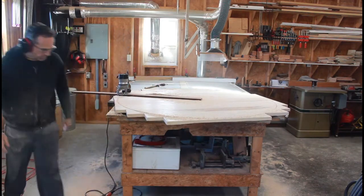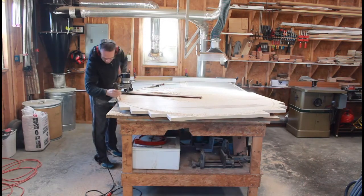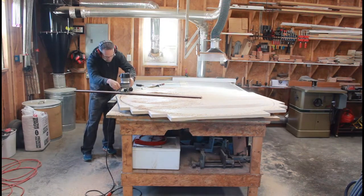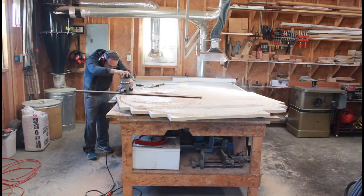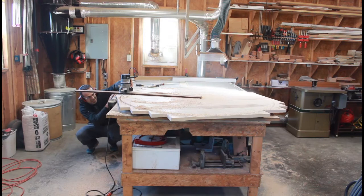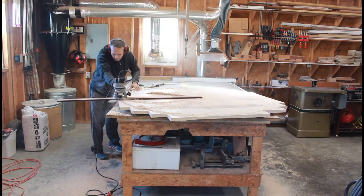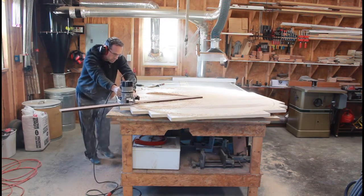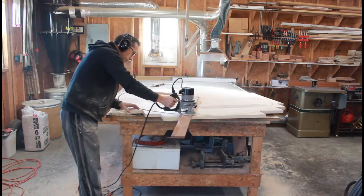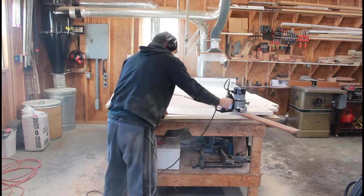It took about four passes. One thing I would modify if I were to do it again: I'd create a little more clearance in the hole I made through the jig so that the chips would clear a little bit better out of the groove. Here you can see I just lowered it further into the tabletop and worked my way around again — this will be the final pass. This is a technique that many people have used for many years. Just trying to demonstrate how easy it really is to get a nice circle with a router, a nail, and a board.